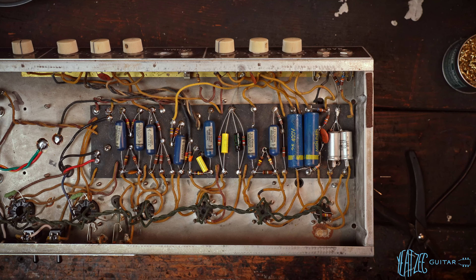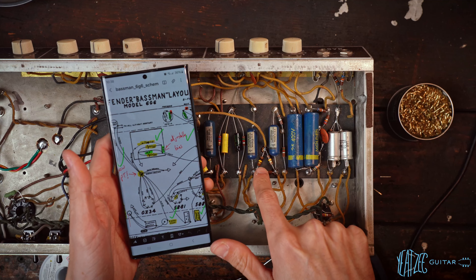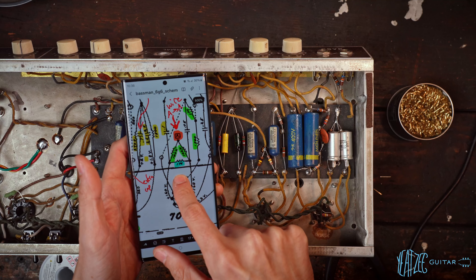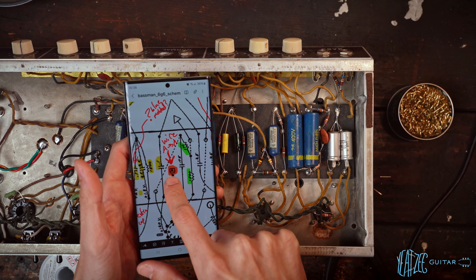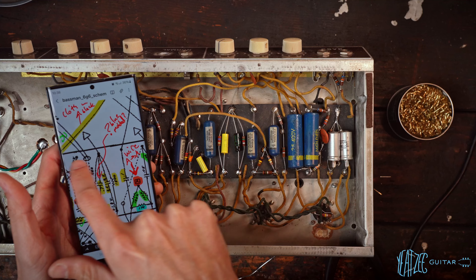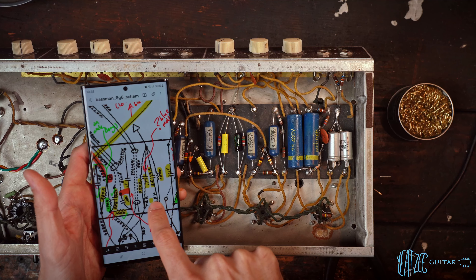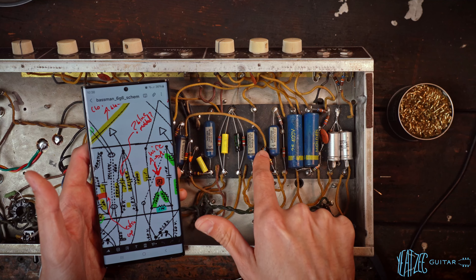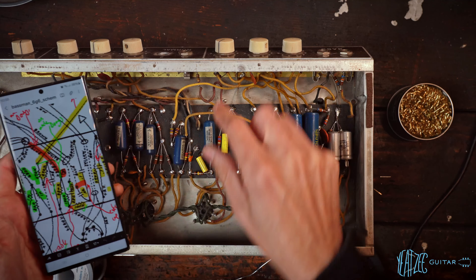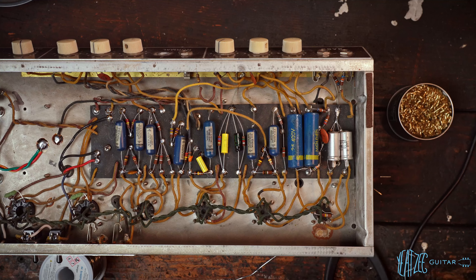Let's just go ahead and get these in and then we'll continue on down the line. We're very, very close. We can see the two plate resistors — the two 100Ks right there. You'll see it says 'A' and then we've got to find where the 'A' is on the schematic. Instead of drawing a wire that would make things confusing going from there to there, they just mark it 'A-A', meaning those two points connect. So we need a wire running all the way over here — we can see a 220K and a 100K, and a blue wire. Let's go ahead and add that in.